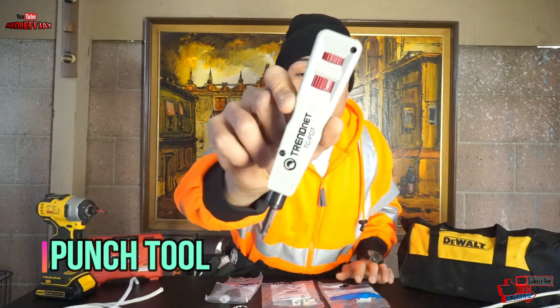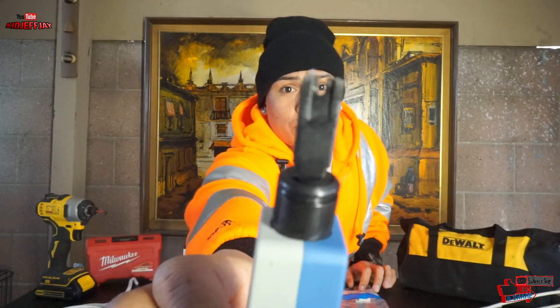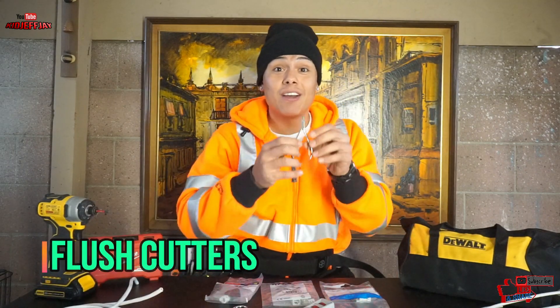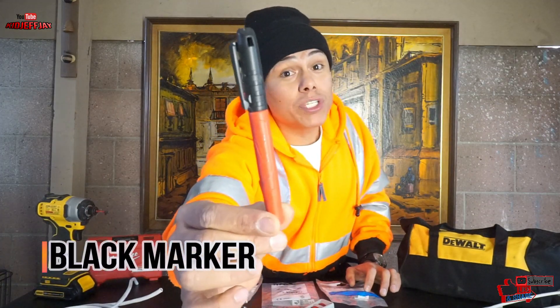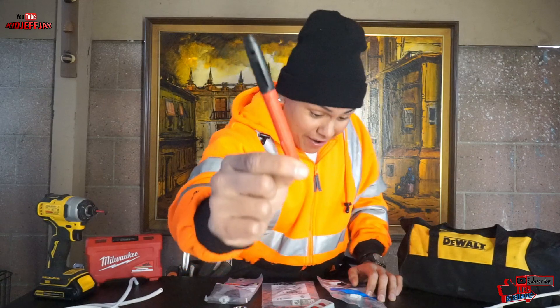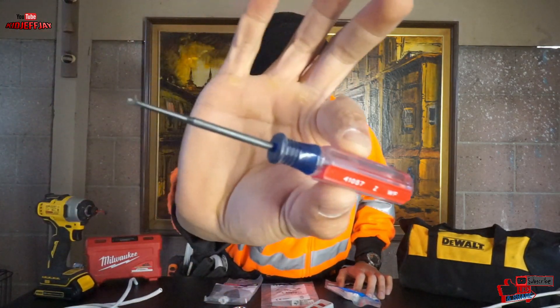And the one and only — the punch tool. This right here is the punch tool. Look at the end — it's a punch tool 110. You can see that little baby blade in there. You need the flush cutters — these look like nail clippers but they actually do the job. A sharpie — in the low-voltage field, let me tell you, you need a sharpie, that's what's going to get you paid as well. And the tweaker — not one of those tweakers you see in the street, a tweaker screwdriver. These are your main tools as a low-voltage electrician.